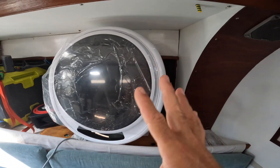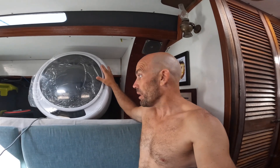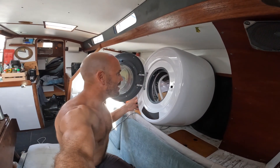This is the spot where I basically want it. Get a bit of marine ply, make a backing for it, actually tab it to whatever's underneath here with fiberglass and really reinforce it so it's super solid, and then attach it to the backing plate and then just plumb it all in. There is not much room in there - have a look at this. Not much room at all. It goes as deep as my hand.